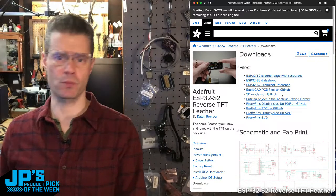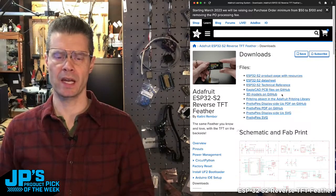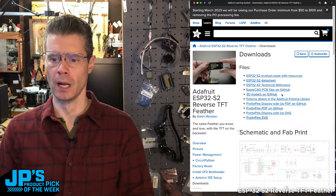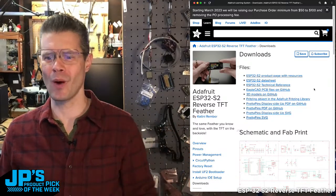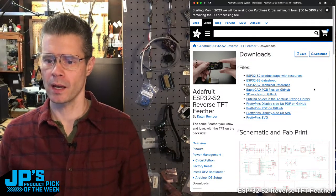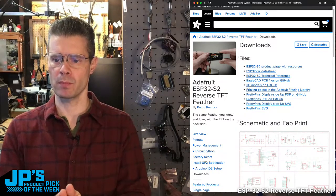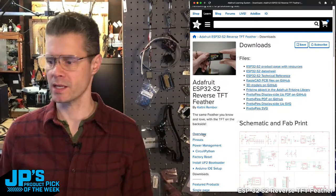When I made this panel, I just brought in that 3D model from the CAD file GitHub, duplicated some of the curves and chamfered them and filleted them a bit, and duplicated the holes that were already in the 3D file for mounting, and it all just worked. I didn't have to double check the measurements or anything like that. Often I don't trust a 3D file out there in the wild. These I trust. I know they're built well, and they're built from the CAD file. And then you can also get the schematic. You can get the Fritzing object if you're doing some work in Fritzing with this, as well as all of the different pretty pins diagrams for this. So you could print one out real big if you're using one of these boards a lot and wanted to have a reference next to you.